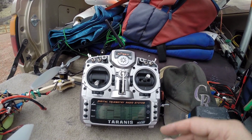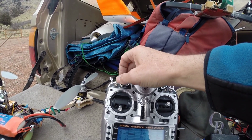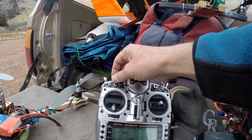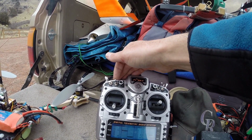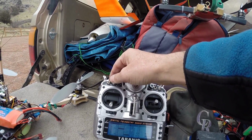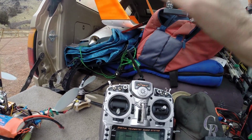While it's flying, I can flip this switch here, and if I flip it up, it will climb. It's saying 0 feet because there's no telemetry right now. It'll give about 20% positive throttle, and it'll climb. The telemetry sends me back the altitude 11 feet every 10 seconds. And then if I flip the switch down, it goes into failsafe and flies itself home. So no matter what I'm doing while I'm flying the FPV quad, often before I'm even done with flying FPV, I'll flip that switch, the relay starts coming home by itself. Otherwise, when I'm in the FPV mode, it's just flying normally.